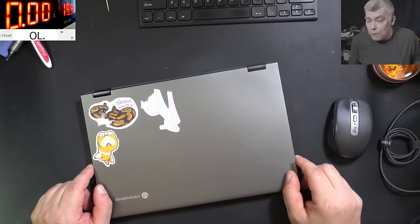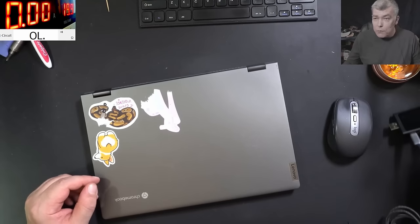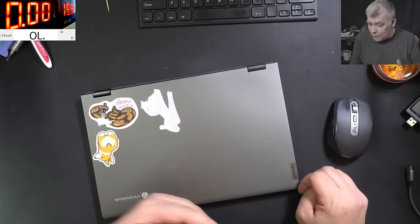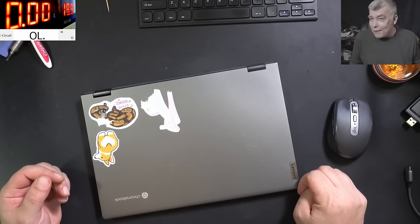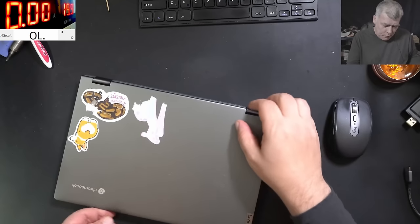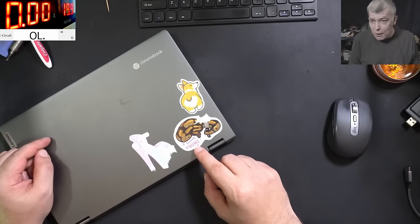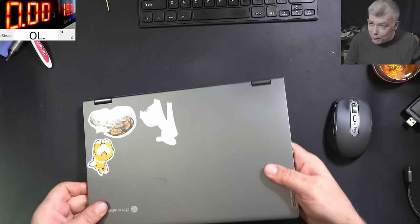Now, because the meter is not getting enabled, what you are looking for is the two pins from the middle of the USB port. Based on that pin signal, the charger will get enabled. Can we do a bridge, some dodgy job? Yeah, obviously we can, but check here, this customer, I crave violence. So I don't want to mess around with this kind of customer. So let's do a proper fix.